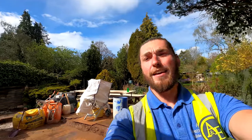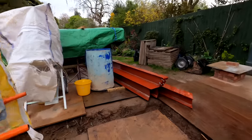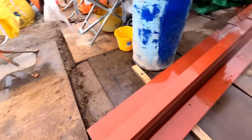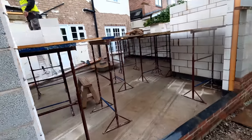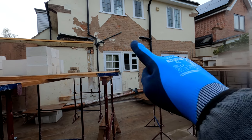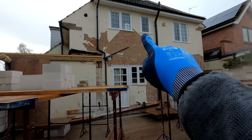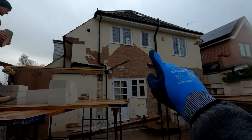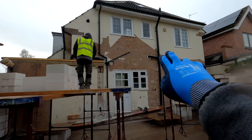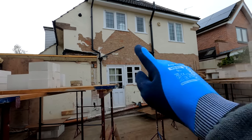It's been a pretty hectic couple of days so I haven't done much filming. Basically today Alex is going to continue with our block work, we're going to get these steels in, we've got a couple more steels to pick up as well today which are going in over there. They'll basically span across — there's going to be a doorway here just with some double opening doors, and then the steels will go across the top because we need to support the brickwork above. We've got a big steel going in up there which is going to be this ridge steel across here, so we need to make sure this is structurally safe — two steels going in there, one for the inner and one for the outer leaf of the wall. We've got padstones to go in over there as well.